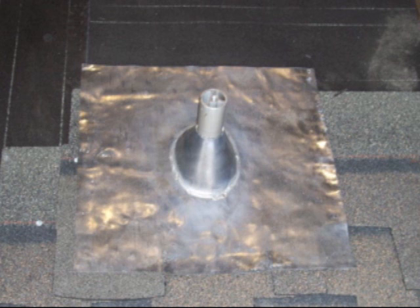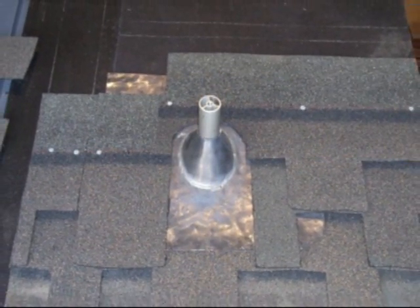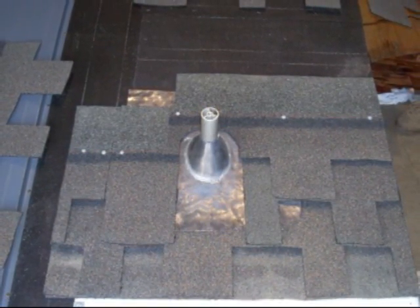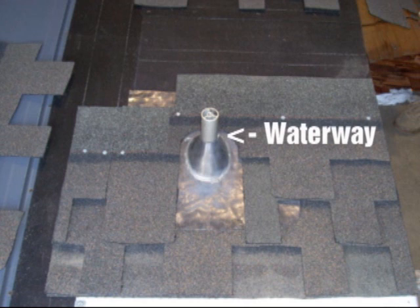I also recommend always using new roofing underneath. This solar's design life is 25 years. If you use something other than a new roof, I doubt very seriously whether you're going to get your design life out of your roof, and you'll be replacing it and removing the solar. Next, the shingle is cut — make sure you make a waterway around the top of it.